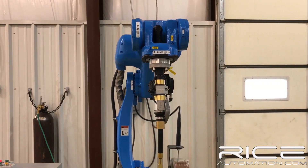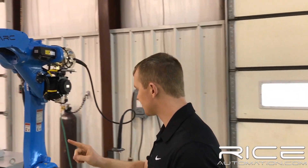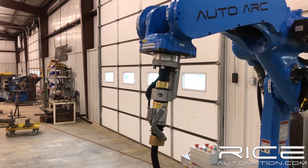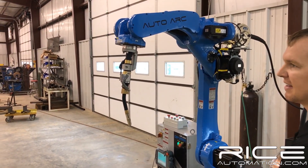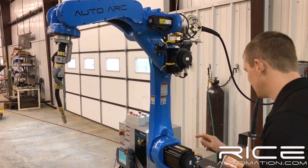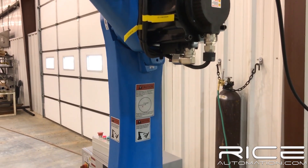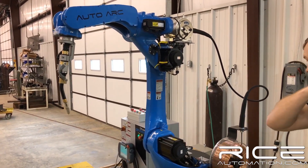When you touch it, feel it, and grab it, you can just tell. Now, touching on one thing — you'll notice all over this robot we've got the zero marking stickers, which is normal. But after use, most of the time those get worn off, and within robotics sometimes you're looking for witness lines that are hard to find, especially when they're caked up. So each axis you'll find a hole — these are your alignment holes. You can stick a pin in there and align it, and that'll get you back to factory zero.